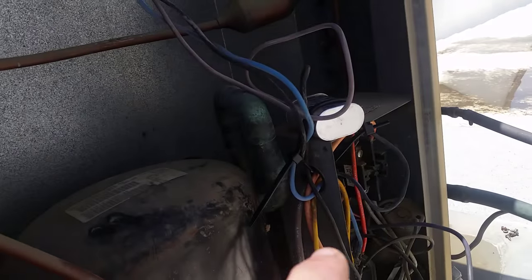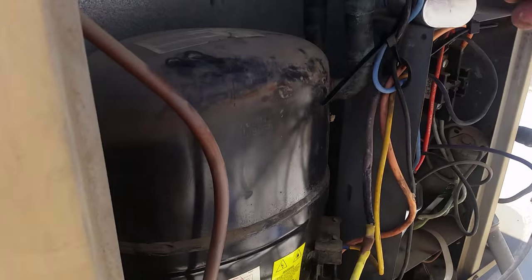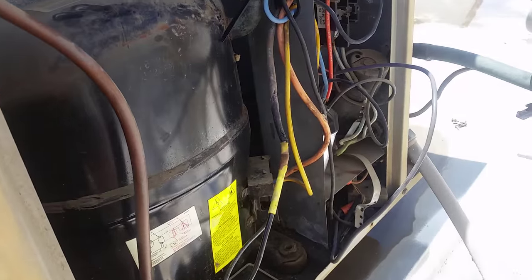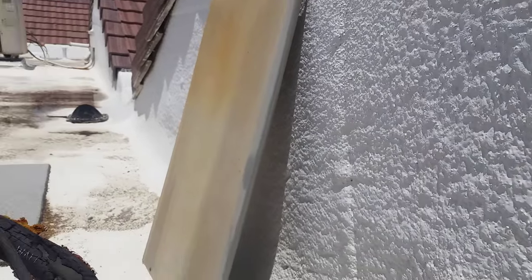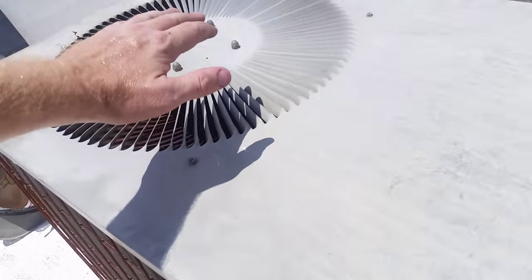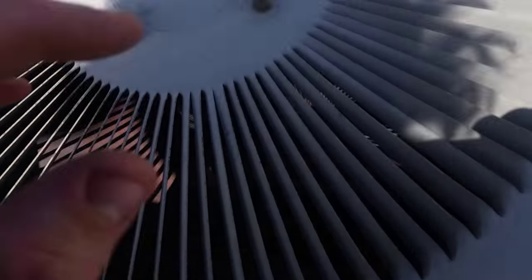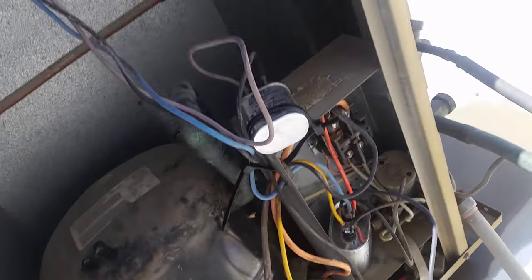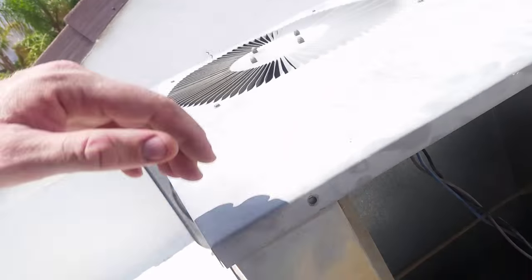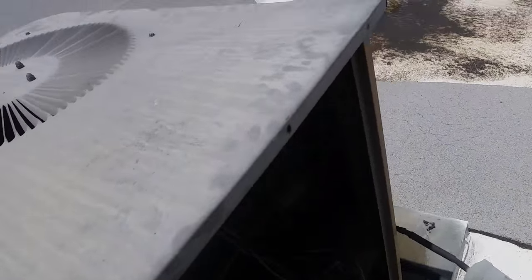Got the fan lid changed, had to rewire the motor, secure the capacitor. Had to run a new lead — I showed in another video how to wire that a little bit clearer. I better hurry up and get off this roof before I get heat stroke. There goes — beautiful, fan spinning the correct direction. Moving heat from the unit. There's the jumper wire going down to the common side, the other side of the fan. Since this was a three-wire fan, just a little bit different.